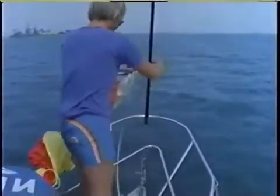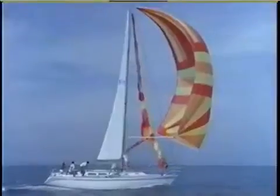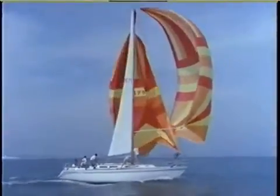The other maneuver that intimidates some crews is a spinnaker change, but it's actually even easier than jibing. The new chute is set up in the bow pulpit. The tack is attached to a changing line at the stem head, and a new sheet is rigged. When everyone is ready, the new sail is hoisted on a second halyard, inside the flying spinnaker. We haven't touched that sail yet. The important thing is to keep it flying as we get the new one up.